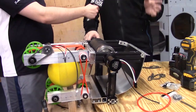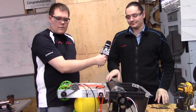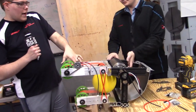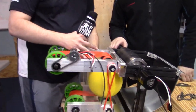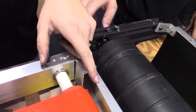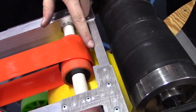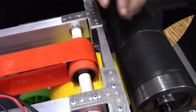Same speed, opposite direction — so you get that linear translation of the ball without any rotation. We're using this kick-up into the shooter. We're having a little bit of an issue right here with the jam. This piece isn't cut down quite enough here. If you want to take a look from the top, it's a lesson for everybody: make sure you design to avoid the pinch points. We're going to be cutting away some more of this material to make it so the ball can come up to contact the shooter wheel.